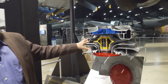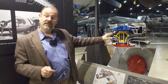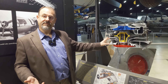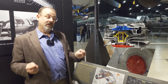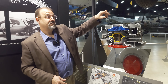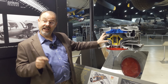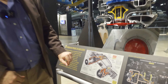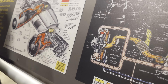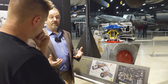What's important is that other countries had superchargers, but a conventional supercharger drives its impeller mechanically off the engine, taking away a little power. The turbo supercharger takes advantage of engine exhaust, so it doesn't cost any horsepower. On the B-17 this turbo supercharger is on every engine with all kinds of ducting. Then that compressed air goes to the engine where an additional supercharger — running off the engine — compresses it a second time, maintaining horsepower at high altitude.